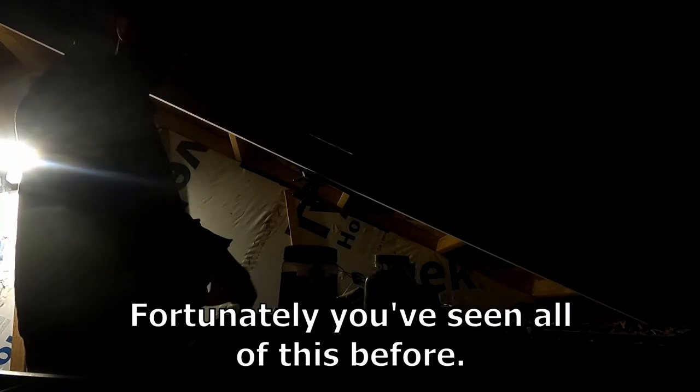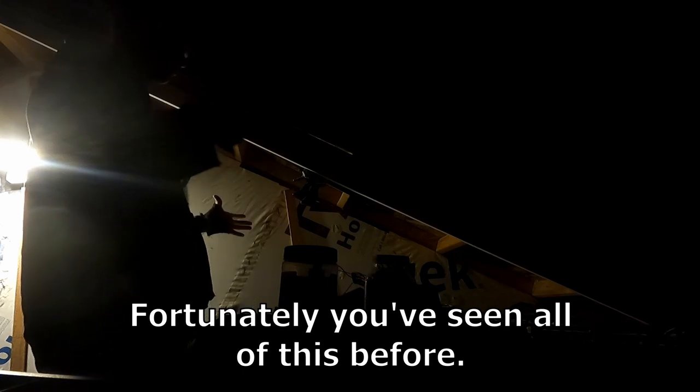The other reason this one's trickier is because it's awkward. This is the roof over the trailer here, and it's super in the way for everything I need to do. I'm actually standing right now on a pallet in the forks of my excavator, used as a makeshift man lift. I got this clamped up, got the glue in there, and I'll give it a few minutes to set up. Didn't bring any rags up with me so it's a mess, but that's the hard bit that needs to be aligned right. Now I can go down the line, screw it through the OSB sheathing at the top, pocket hole it from the back side, get it all secured, and then go to the far end, trim it, and fit it.